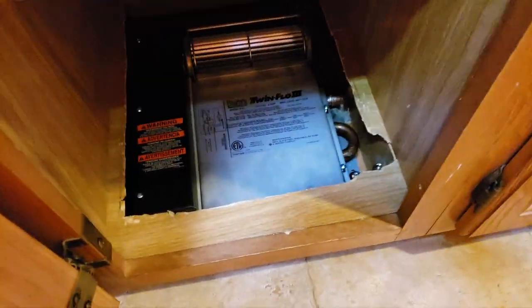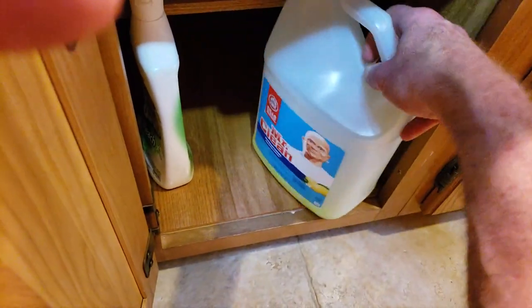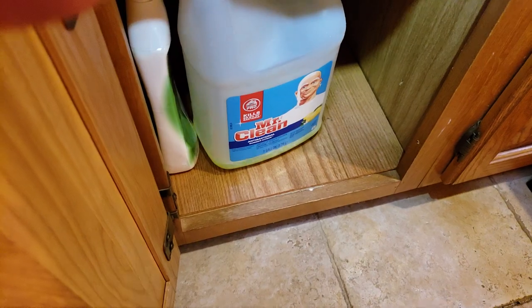It's a Beacon Morris unit. I made the enclosure out of plywood and thin quarter-inch steel, wired it, and gave it its own circuit breaker. We have a sub-panel with about seven or eight empty breaker spots, so it was easy to just put in a 15-amp breaker.